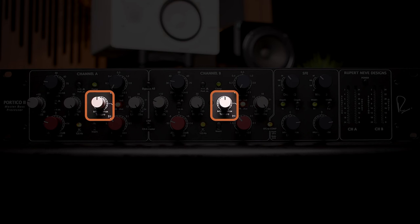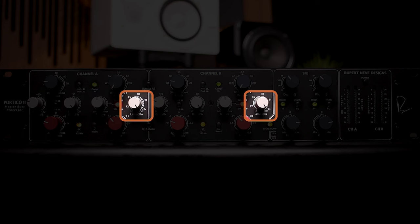The texture knob adjusts the amount of silk transformer saturation added to the signal path when silk red or blue modes are engaged. The limit knob controls the threshold of the soft clip limiter section. The limiter is disengaged until turned past the third detent. As the threshold is increased, the limiter's release time increases. This creates a smoother dynamic response as the amount of limiting increases.